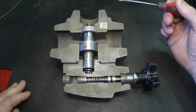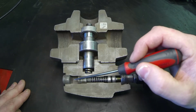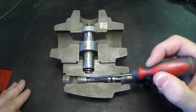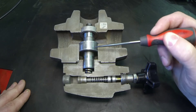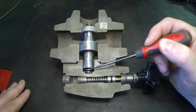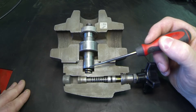Let's say this relief valve is set at 2000 PSI and the load is at 1200. There's going to be 1200 PSI here, in here, and up here. The way a pilot operated relief works is that there is a second valve — the upper pilot valve — that is actually used to open at the predetermined pressure. This allows us to have a smaller pressure override. With a large direct acting 3000 PSI valve, a really large spring holds that spool closed, so the valve starts cracking at 2500 and is fully open at 3000. Our system reliefs are set at fully open — that's the pressure we're looking for, not cracking.